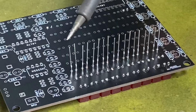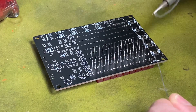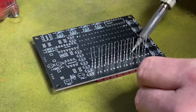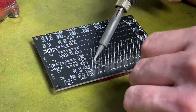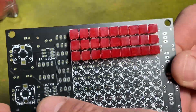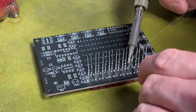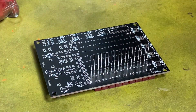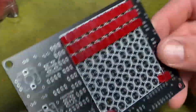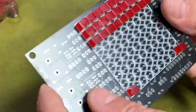The trick here is to get the LED legs facing straight up. I add a little bit of solder, turn my soldering iron, and just solder one leg on carefully, then do the next one. I check the work to make sure they're straight — pretty straight to me — then add solder to the rest of the legs. I'll check again, trim those, and repeat another six times. I won't bother filming all that and I'll show you what it looks like at the end.